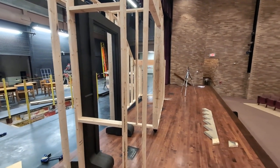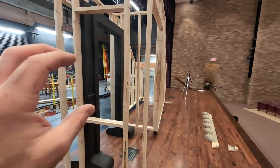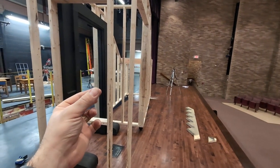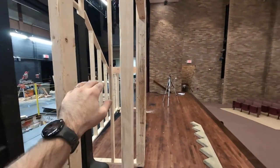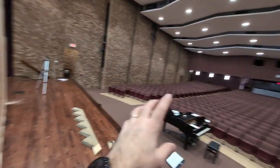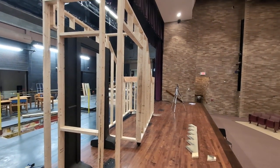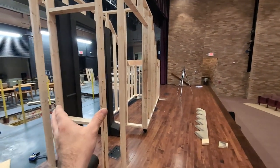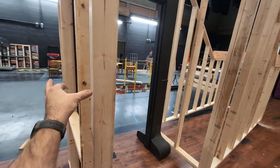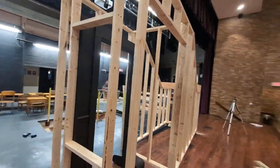But expanding foam isn't controllable in between all of them. And then I started thinking, well, you could make it out of 1/2-inch thick false brick. And when you put that on, being in there 1/2 inch, that will look like mortar well enough to the audience, having that relief, or 1/4 inch or 3/8 inch, however thick we make them. But that would just mean that I need to bulk this up with Luan as well to be the surface of the mortar. And then we'll stick the fake bricks on.